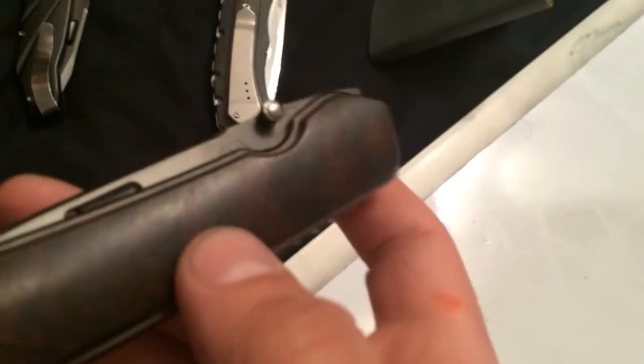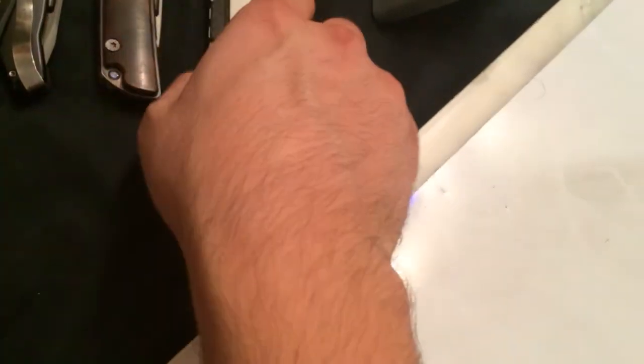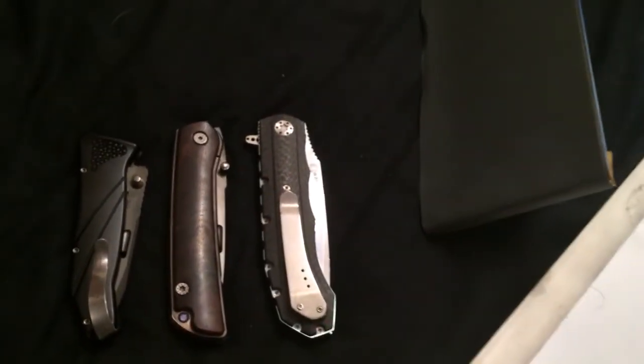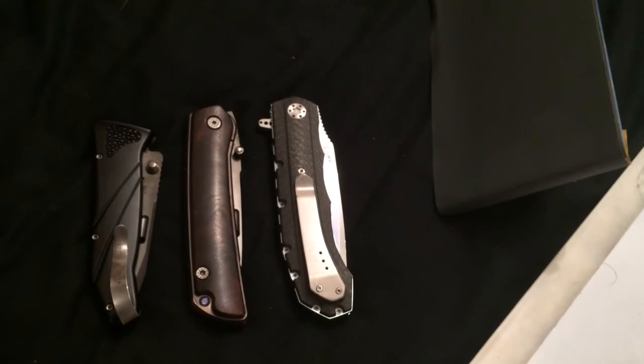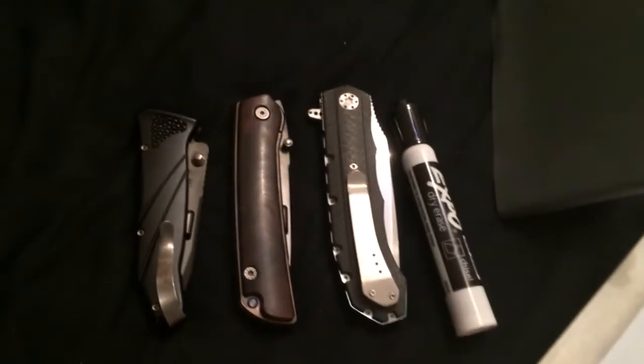So that's really it. One more thing I want to touch base on is the sandpaper that I use, which is obviously wet dry sandpaper, which the abrasives on here are silicon carbide, which are way harder than your blade steel. And that's important to understand, because if you're using certain polishes like Bacal features, what is it, aluminum oxide, Flitz features aluminum oxide, what was the other one, Simichrome features aluminum oxide. Those, aluminum oxide and silicon carbide, are way harder than your blade steel. They're way in excess of something that's 60, 67 HRC and whatnot. You can't even measure a material like silicon carbide on the HRC scale, because it just doesn't work like that. It has to be measured more on the Mohs scale.